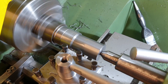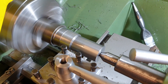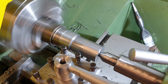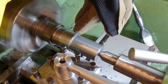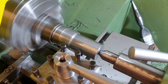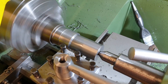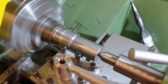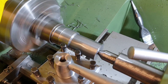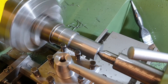With the fixed tool post in place, I'm going to make some test cuts working with a piece of bright mild steel. I don't know the grade — it's around about 36 millimeter diameter on this section, which is where we're going to be running the cuts. The first cut will be 0.2 millimeters depth of cut off the radius, running at around about 800 RPM on power feed, geared for 0.13 millimeters per revolution.